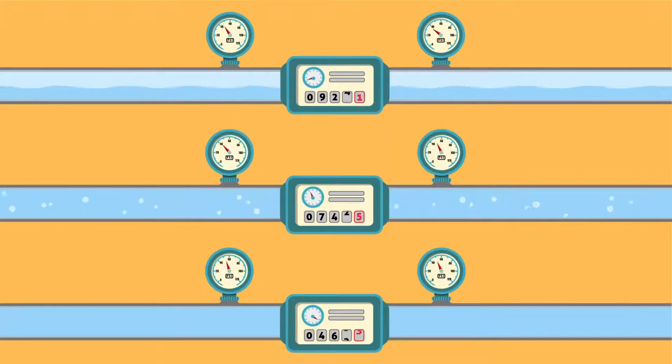the volume of the air increases whenever and wherever the system pressure drops. Over 99% of water meters measure by volume. It doesn't matter if the volume is all water, all air, or a mix of both — the water meter will measure it, and the water company bills you accordingly.